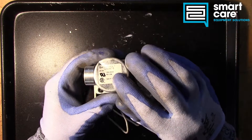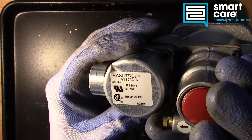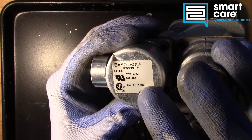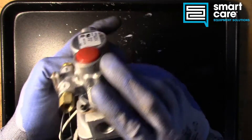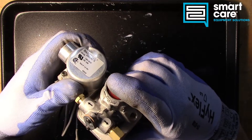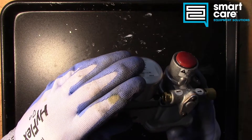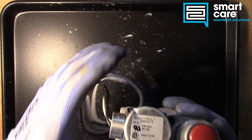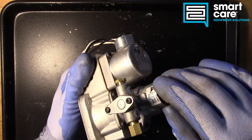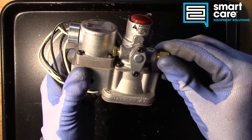When we look at the labeling for this, we can see it's a 120 volt 60 hertz solenoid, set up for natural or LP gas up to 1.5 psi. What's probably going on here is whatever this gets installed in has a standing pilot, and this is the pilot safety valve. Then whatever calls for heat in that system energizes the solenoid, so we could be turning a burner on or off with this. Our pilot gas will flow through this part of the assembly, so the pilot would stay lit all the time.